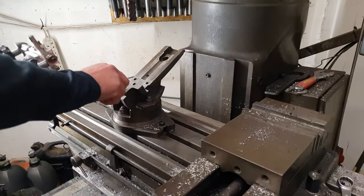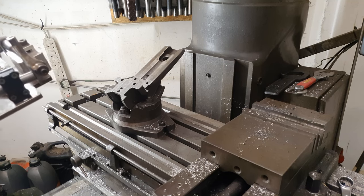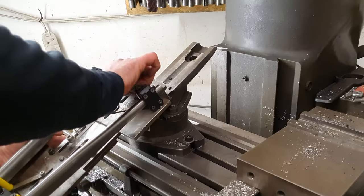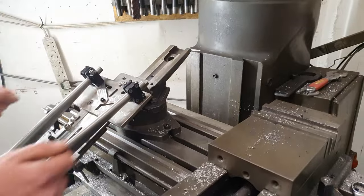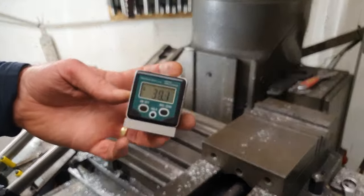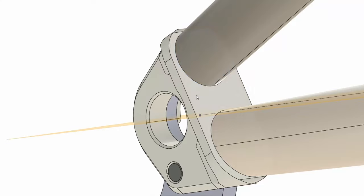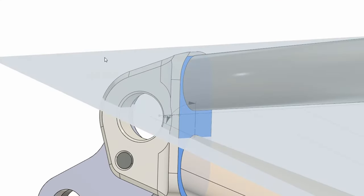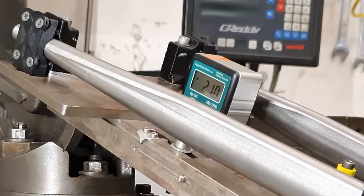So for doing the notches on the rear of the stays where they meet the dropouts, stick them here on the bridge port. And that will give me the angle that I can set the chainstay fixture to the angle of the dropouts. Use a little digital angle finder. And we want 20.97, if you can get it. 20.97 is 21, isn't it?